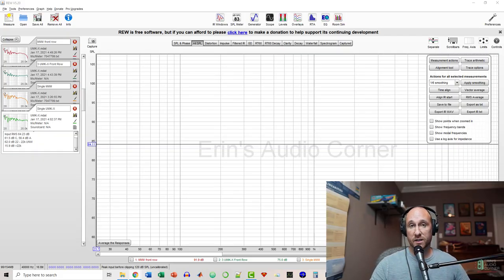How accurate is the U-Mic X versus your typical measurement method — using a single microphone and waving around to the headspace? An array microphone is definitely different than a single microphone waved around the headspace on a boom — you've got placement issues. So if you're talking about an absolute apples-to-apples comparison, you're probably not going to be able to really make that. What you want to pay attention to is the low frequency and mid frequency, because those wavelengths are longer than the actual distance from corner to corner of the U-Mic X, and therefore theoretically they shouldn't be much different, assuming your microphone is placed in roughly the same space.